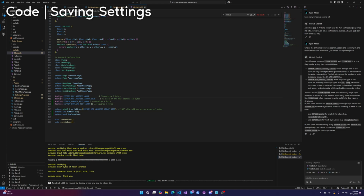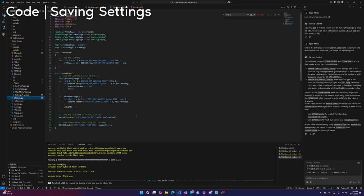And then, of course, the define is a similar thing. Well, define is like a constant. External variables can be changed. This cannot be changed after. But anyway, we go to here. Okay, so now within the save function, we are saving this value to EEPROM at this address. Okay, but we also need to load the value because just saving it is completely useless.